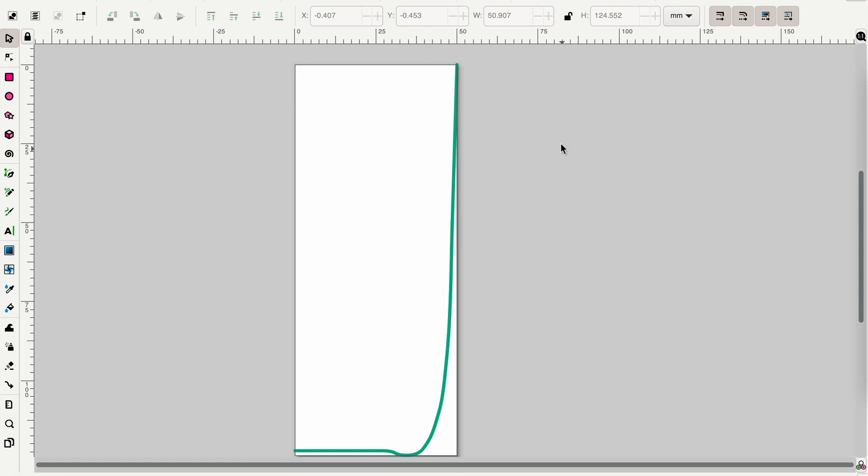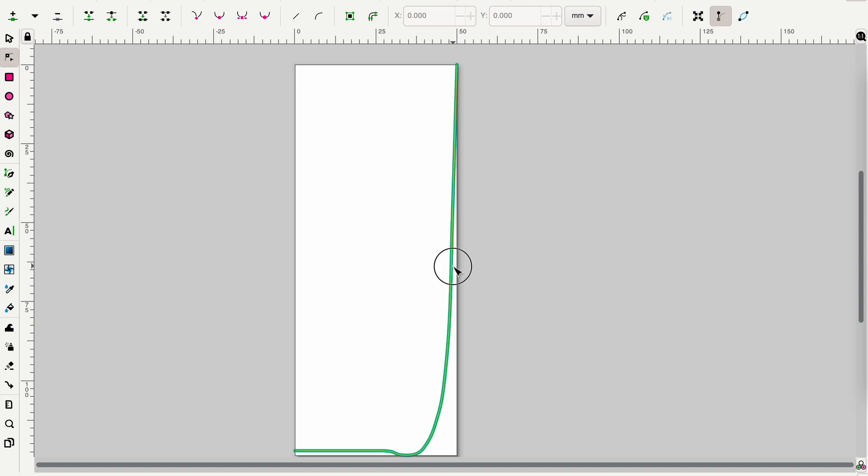But how did I get these 3D printed shapes? This all started in the computer. This is Inkscape — it's an SVG vector graphics drawing program that's open source. What I did was sketch out the form of my pot. You can click here and see all the control nodes. This is a slice through the pot, only one side of it. The idea is that we will revolve it around the central axis — this will be the middle of the bottom of the foot, and up here will be the top outside of the rim. We swoop down to create the foot and then come up the side to create the outside curve. Then the software takes over and does the rest.